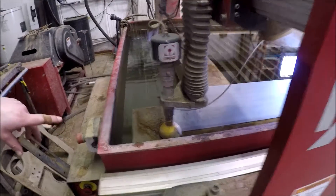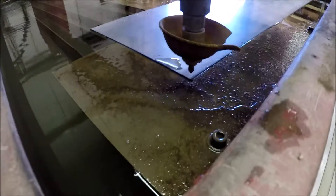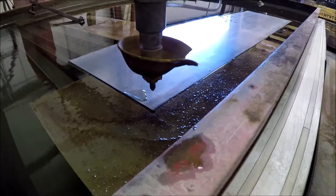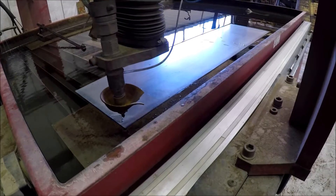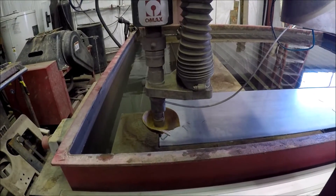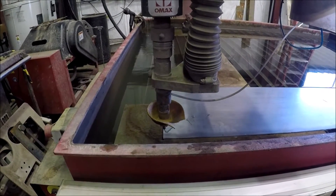The water then goes into the mixing tube at the other end of the nozzle. The ID at the end of this tube is 30 thousandths — that's the cutting width. When you do a tool path, the machine automatically offsets based on that size. As the nozzle wears you increase that offset a little, put a fresh one in and bring it back to spec. The pressure coming out of the tip is 60,000 PSI. What you see here is garnet abrasive — the vacuum created by the water passing through so quickly pulls the garnet down through the tube and mixes with the water.